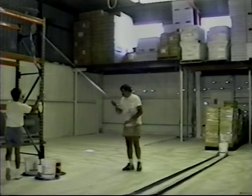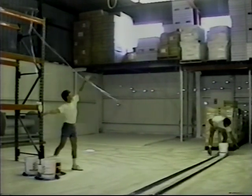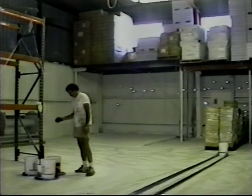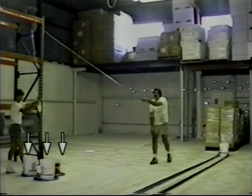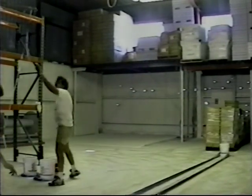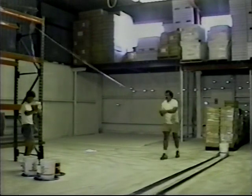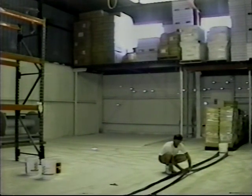To cut leaders to a predetermined length, start with one or several skeins or spools of monofilament leader line and set up anchor points spaced at the desired leader length — any type of fixed point can be used. In this case we are using three skeins of 2.0mm monofilament and making 10-fathom leaders. The three ends are routed up through a block located directly above the skeins, then pulled and wrapped around the pre-measured anchor points until the skeins are empty. The bundle is then taped at intervals of 3 to 4 feet to avoid tangling and make it easier to handle.